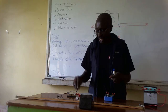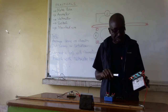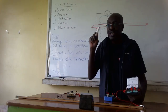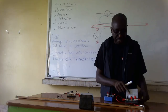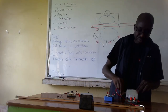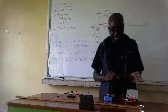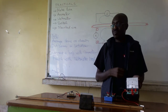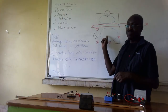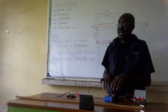When it is connected, you now put in your key. If you put in your key it means the circuit is complete. Now I want you to check the deflection. The deflection is below zero — you don't need to cram. When your deflection is below zero, you swap the wires. Take one from positive, bring it to negative, and the one which was on negative change it to the other side. Now you see your ammeter can read. I have finished with the major loop, so I remove my switch so that my battery is not running — I conserve the EMF.